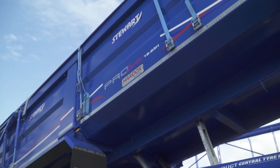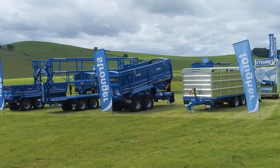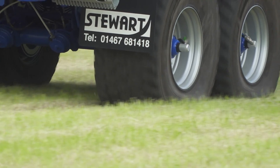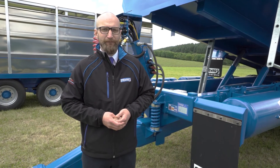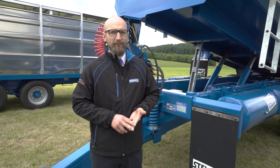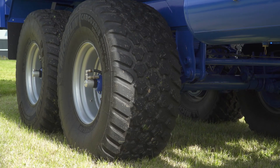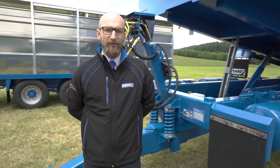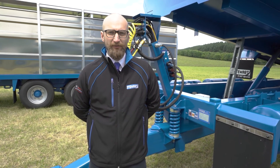Towing the trailer with road pressure in the field will cause it to sink, creating a deep rut. The trailer needs to overcome the mound that constantly piles in front of it, making the tractor work harder and use more fuel. By using the correct field pressure we remove that problem and reduce wheel slip. Using flotation tires with the correct pressure will protect the soil, reduce tire wear and save fuel. All of that will save you money, so let's start using the tires in the correct way.